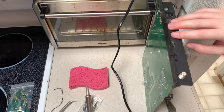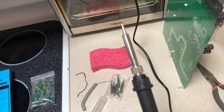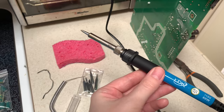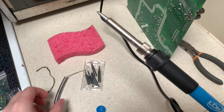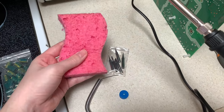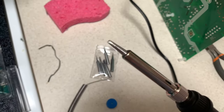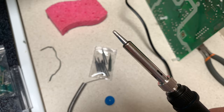Alright, so this is my setup. I've got the capacitor just resting against this toaster. Here's my soldering iron — I've got it set to 260 degrees Celsius. Google says that's what you should solder capacitors at, so they can stay below 105 degrees. I've uncoiled my tin and I've wet a regular kitchen sponge. That's about over 500 degrees Fahrenheit — it's very hot. You want to be careful and you don't want to touch it.